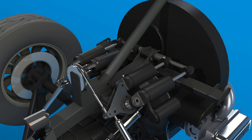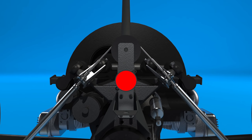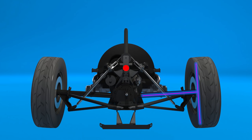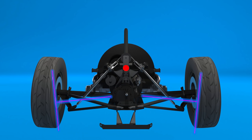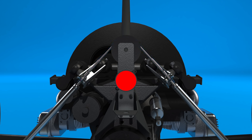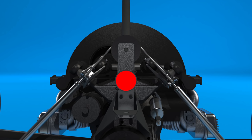That's two of the three aims I had down. Third, I need to control the rear camber. The wheels on a Formula V connect directly to the end of the axle tubes with no universal joint. This means that when one wheel moves up or down, it changes the angle as well. A consequence of this is that the car's rear roll centre is very high, which induces quite severe jacking at the rear of the car as it goes around a corner. Effectively, the forces imparted on the car by the wheels force the rear upwards as it corners, and this leads to positive camber due to the axle tubes — very bad for grip. To do this, a camber cable is typically used in Australian Formula V, simply preventing the two wheels from drooping too far while still allowing them to droop independently as a consequence of roll. I opted for a cable running from the bell cranks over a pulley to perform this function. A guide will be necessary to prevent the cable from coming out of the pulley when it's unloaded.